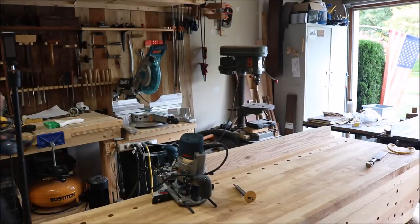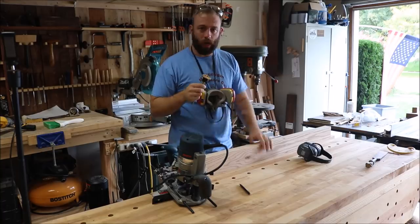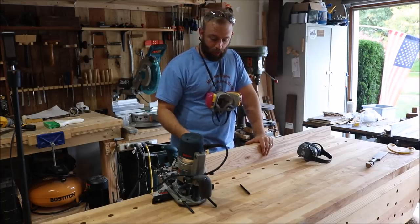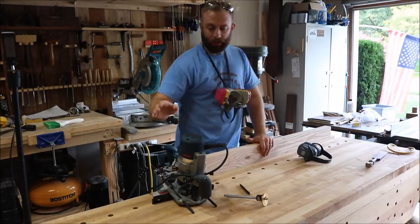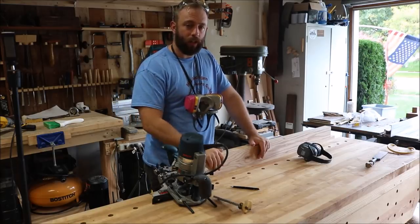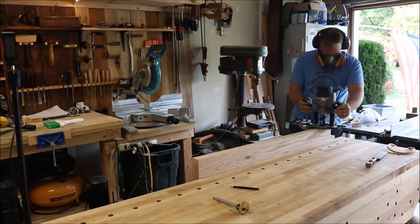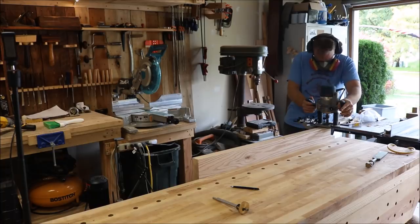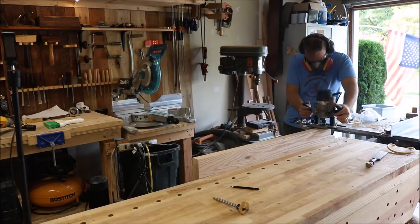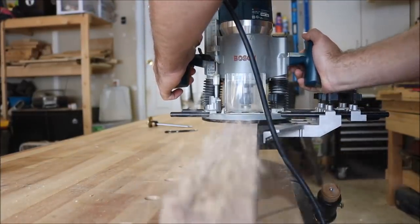Now that the tenons and tongue are cut on the table side, I'll move to the breadboard end. I took a marking gauge and used it to set the depth over on the table part, so I know exactly how far down from the face I need my router to go. I use that to transfer the line to the breadboard end. I set my router fence to that distance and also set it so that it'll plunge in multiple steps down to the right depth. Being that this board was two inches wide it was actually pretty stable, so I didn't have any problems.